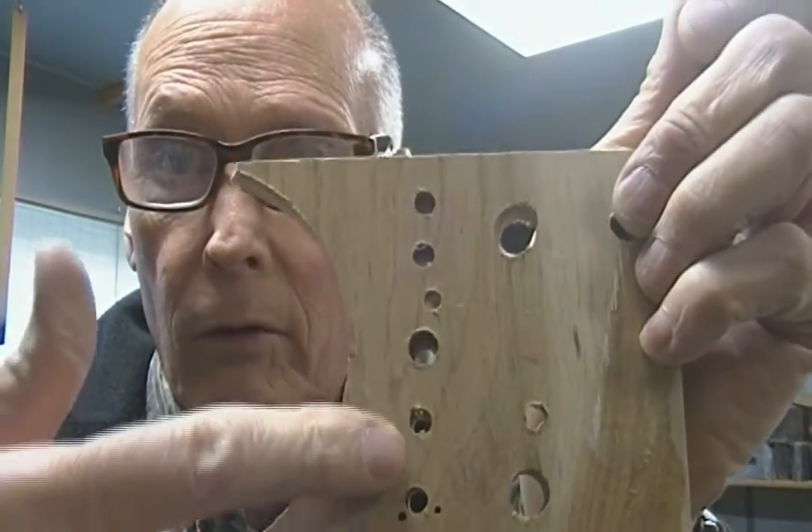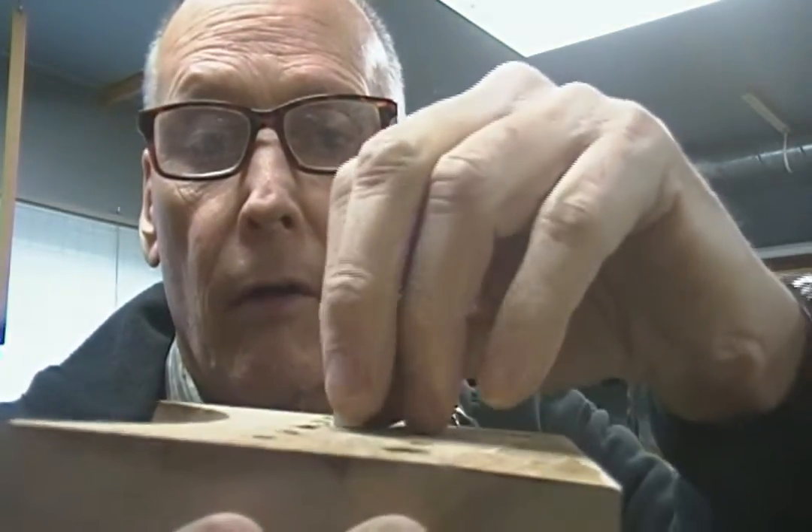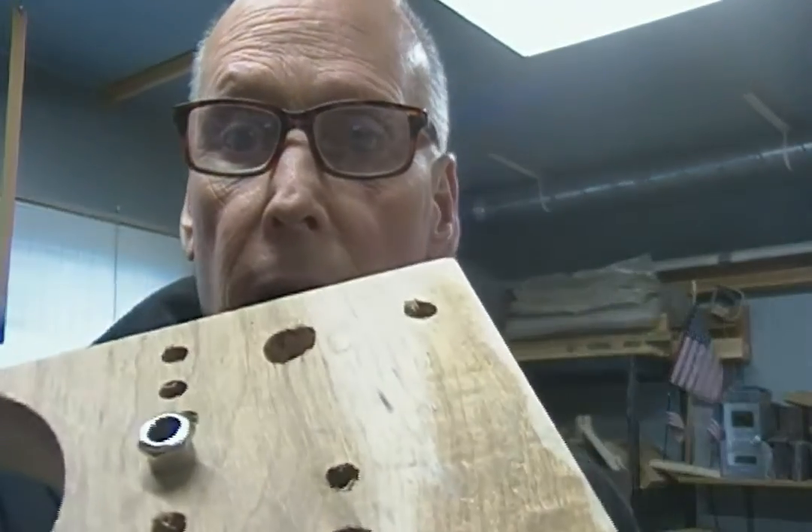Well, I just thought I'll drill some quarter-inch holes in this scrap block, which are these holes right here. This is the hole with the step. It's actually just a tad snug in there, which is perfect. Because I'll just go up and down a couple times with it as I'm reaming that hole, and it should just push right in there and not need any glue. And apparently it's not off-center enough that it enlarges the hole, so I think we're in good shape.